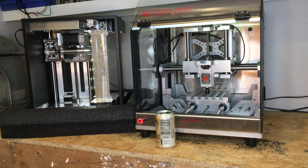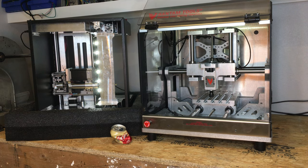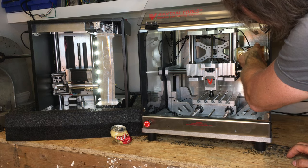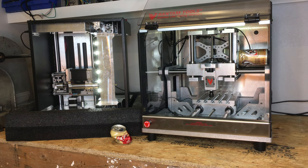Let's go back and do a G0 Y minus 120 to drop that can out of the way. I think we're going to try it again with a different coke can — I'm going to put a dimple in it. So we've got a can with a dimple in it, otherwise normal, and we're going to see if that helps. We'll put it in there with the dimple and do a G1 — let's go with F200, so we'll go real slow, two and a half times slower. G91 and X plus 100.